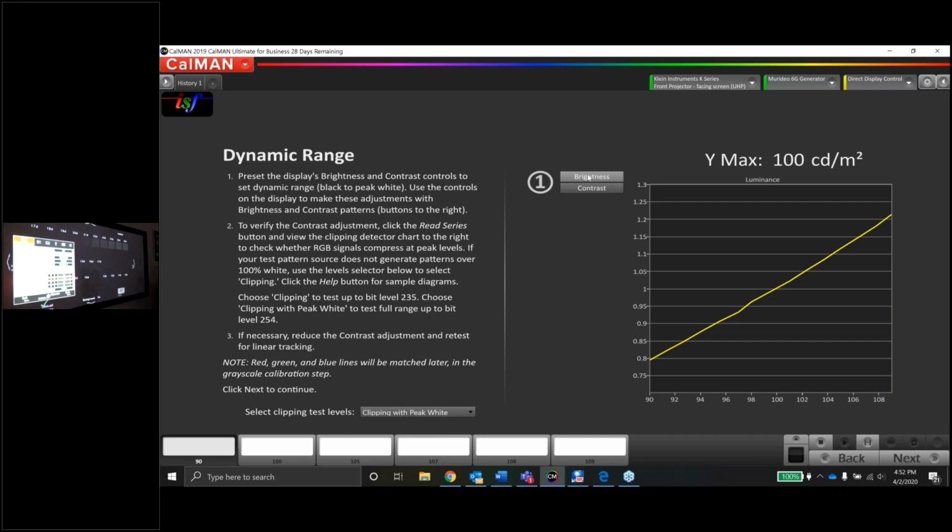I don't see 17 from this seating position until right about 6 or 7 on the brightness control. And of course, guys, that might change. If this room was pitch black and I was doing this at 11 p.m. instead of 4 p.m., you know, it's nice and dark outside. I won't have any of this ambient light in here, and I might actually be able to bring the brightness down to maybe like +1, +2, +3, or +4. But in this room, at this seating position with this lighting, 6 seems to be the winner.